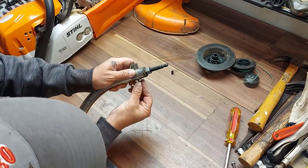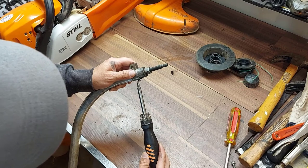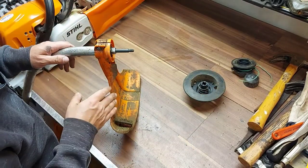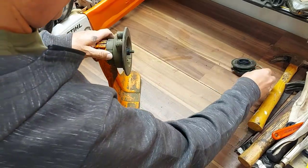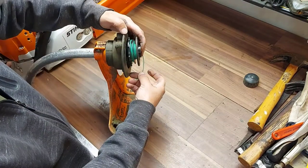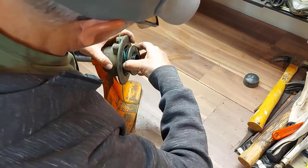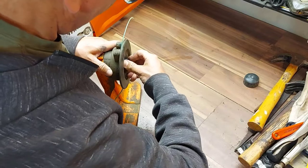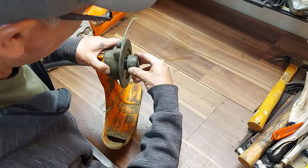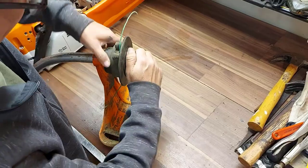So we'll go ahead and put everything back together. Put that back on, then put this back on the line spool. Just slip the line back through the holes — that just slips into place. Give it a little turn there and it'll stay in place. Then you can put the bump cap back on. Snug it up, pull your strings, she pops — it's good to go.